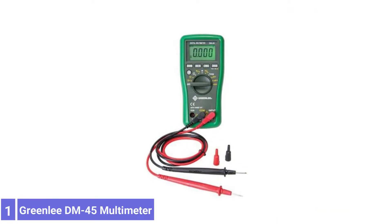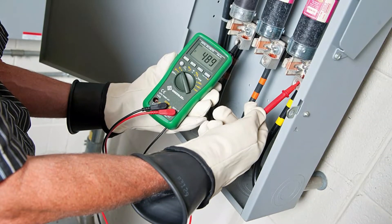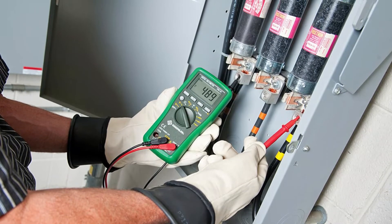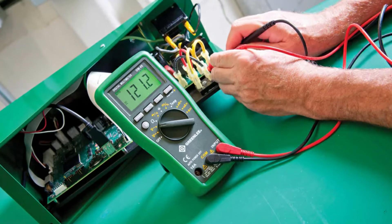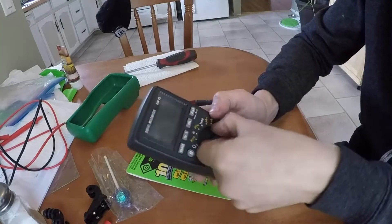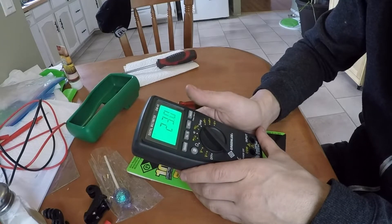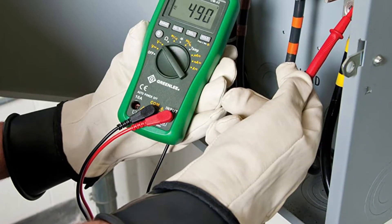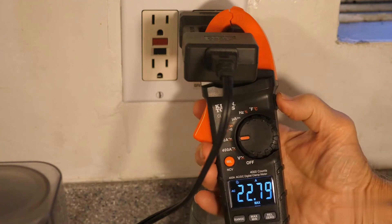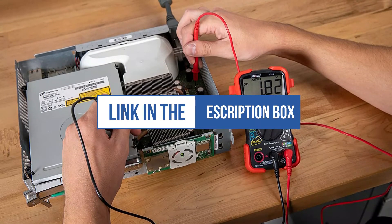Number 1: Greenlee DM45 Multimeter. This digital multimeter from Greenlee features auto-ranging capability to do away with guessing at the current being tested. It comes with standard black and red probes and a built-in stand. The Greenlee operates on a 9-volt battery and tests AC/DC voltage, resistance, and current, in addition to capacitance, duty cycle, and temperature. It also has a backlit display with a bright green color, making reading it a breeze. We like the cutout in the back for the built-in stand and screw hook, making it easy to set atop an engine or hang from a screw or nail. The green backlight was the brightest in the test, with the green color offering a nice contrast. All purchase links are available in the description box — don't forget to check for updated pricing. We will be back with more videos soon.